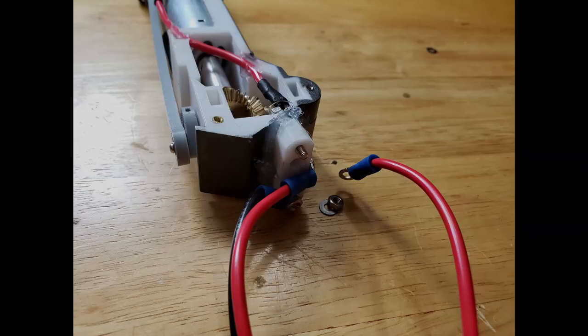So right away in the beginning with the tomato, we noticed that the knife was kind of sporadic. Well, what I found out was that was actually because there was a wiring issue in the back of the connector. And what happened was the vibration of the knife itself actually caused the nut to spin off. And so the electrical connection was constantly being broken and open again so that it wasn't getting a constant flow of electricity. So the motor was kind of sputtering. That eventually came all the way off in the end when it stopped working entirely.